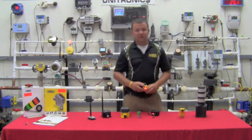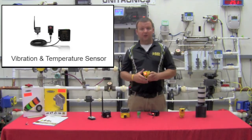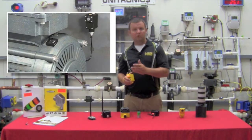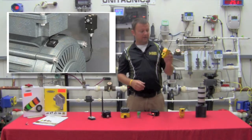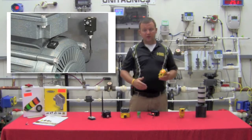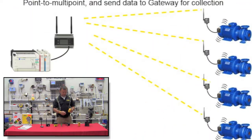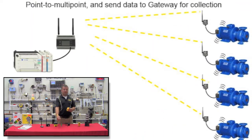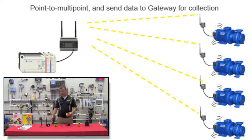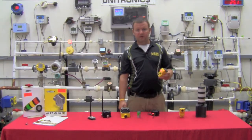One of the other things they've done is to combine a wireless node with a temperature and vibration sensor. The temperature and vibration sensor can magnetically mount right to the outside of a drive, motor, or fan. You can basically take this conduit-free, battery-powered wireless radio and do field surveys on equipment for PM purposes — walk up, set the vibration sensor on the motor, set this down next to it, and it'll talk back to my gateway and feed that information into my PLC to help plan for preventive maintenance.